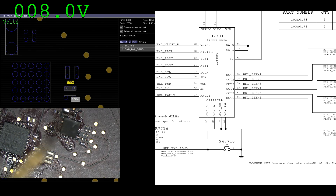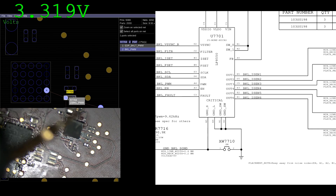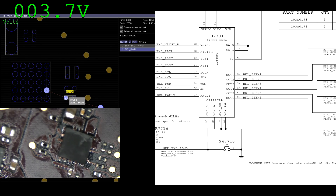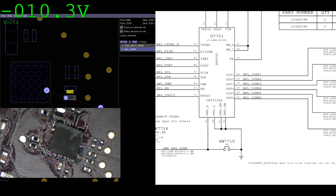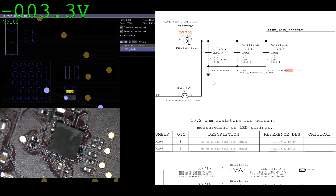Let's check backlight PWM — 3.3. So it's being told to be bright. Let's remove this LED driver and do some testing. I think that feedback is not connected. Feedback is going to be between here and here.